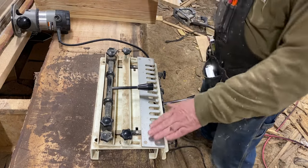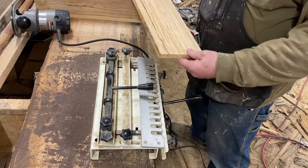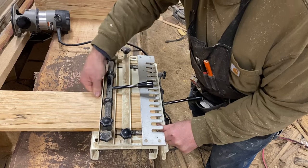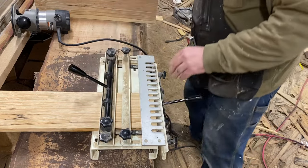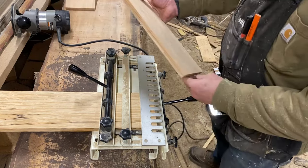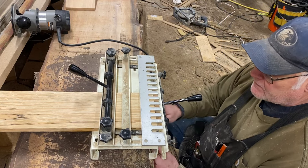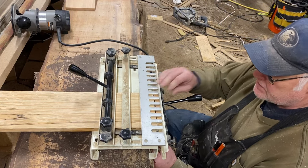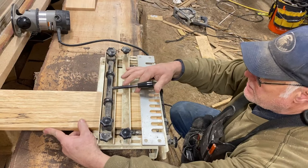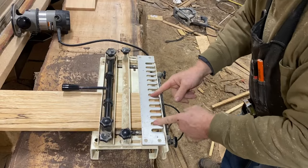The front and the back go on the tops and I marked mine. If it comes in like this, you kind of lay it in there, and then the corresponding mark goes up from the bottom. Bring it up until it just gets to the bottom of this. There's a stop right here and a stop right here. Line these guys up so that they are perfectly square and accurate.